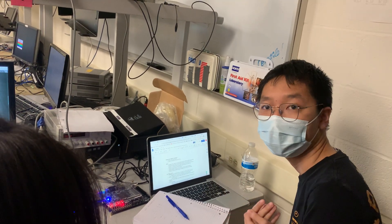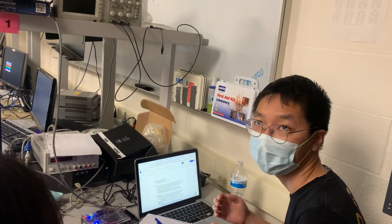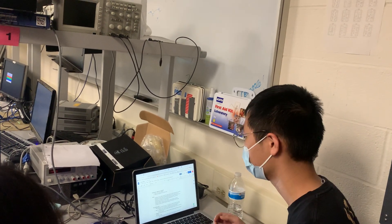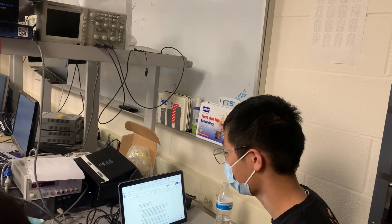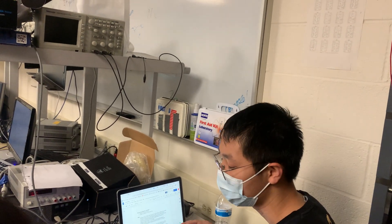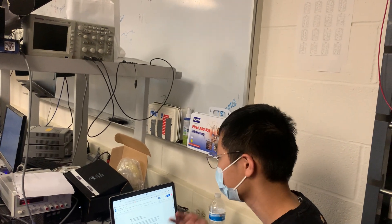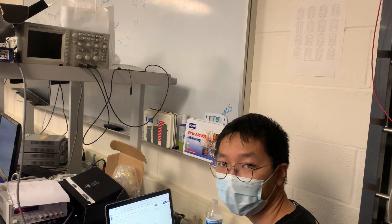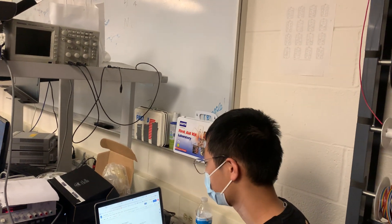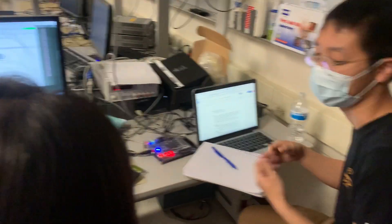There are three main objectives of this project. First is to build the Enigma machine, then we implement the Bombe and Enigma and use the FPGA to compute some possible plug board settings, like partially solve the plug board setting, and then at the end we use a C function to check all the possible plug board settings and decrypt the full input message to see if they match.